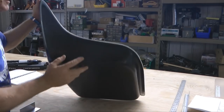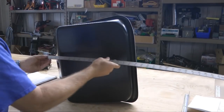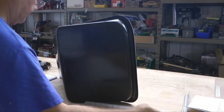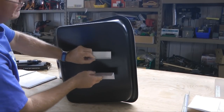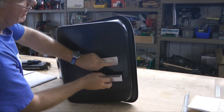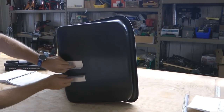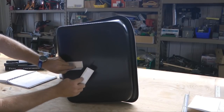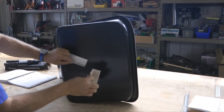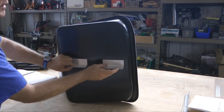Here's the seat bottom and the flat area here — it's just about a foot across, about 13 inches. So these brackets are going to go something like this, centered from side to side, and then our 2-inch tube will be in the middle. I'm going to place a pair here and a pair here. So I will measure the distance from here to here so that I can put these on the tube in their proper location.